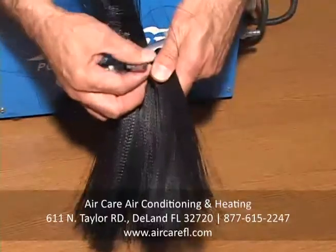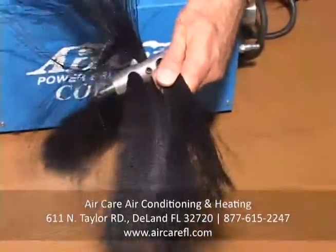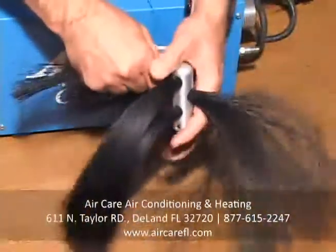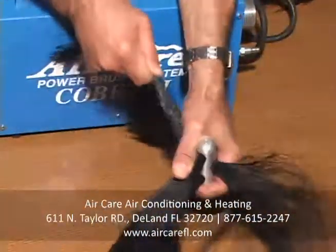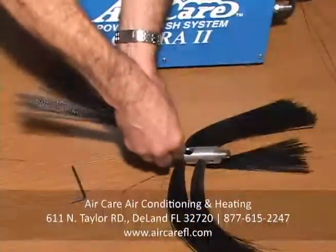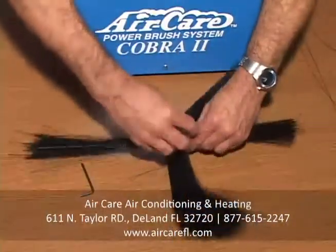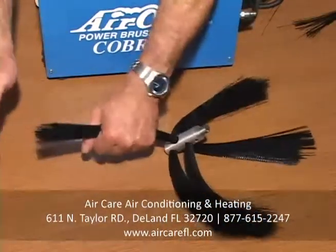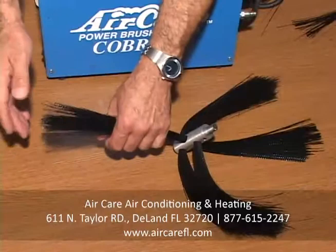First, remove the old bristles by loosening the 3 set screws holding each bundle in the hub and pull them out. If necessary, cut the bristles near the hub with side cutters, then pull them out. Insert enough bristles to make the bundle snug and center each bundle before tightening the set screws.